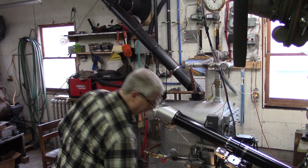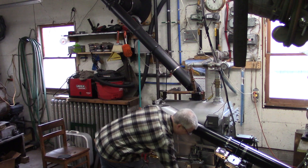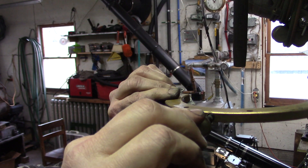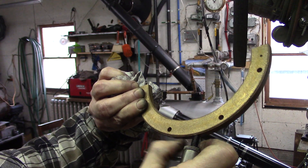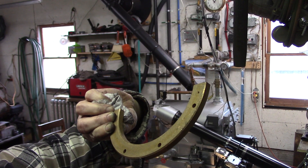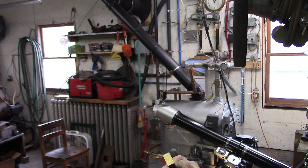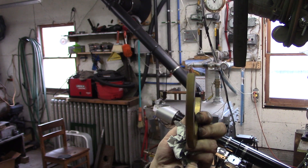Okay, now we're going to pull these off. This one goes in the bottom, and I'll show you why — because this one has the hole that the wick oiler screws into. Now the wick, for those of us who know some things about old machines, actually has to come through that hole. So we're going to have to pull this out a little bit — be careful not to break it because if you pull on it too hard it will break.